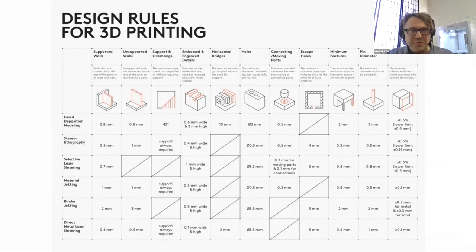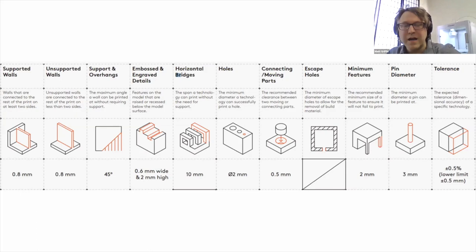Here is a really handy thing you might have seen online from 3D Hubs — a poster where they collected what the field sees as the key considerations for designing for additive manufacturing technologies, and they made a nice big grid. It has a bunch of technologies; we're only concerned about the top line here. We won't go into all of these, but it's useful to look at. I'm going to mostly focus on items that are a little more counterintuitive, but you can see classic options like minimal wall thickness, overhang support considerations, fine feature considerations, and bridging holes. If enough of you are interested, I will do an hour-long version of this content to give you more design for FFF solutions.